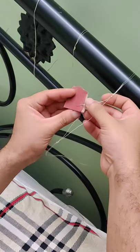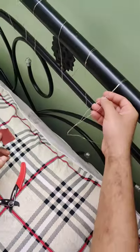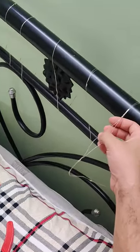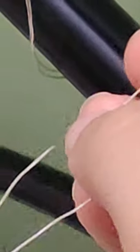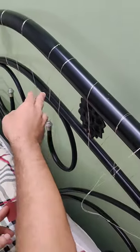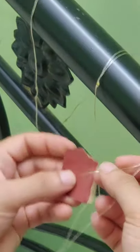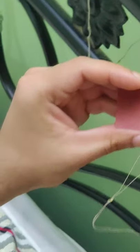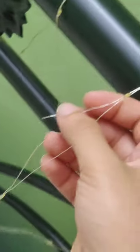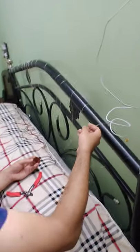So now as you can see, these wire ends are cut. You cannot directly solder them because these fairy lights, even though they are made of copper — copper should be brown — but since these are silver, that means they have a small non-conducting material over the wires so that the wires don't short. If the material was conductive, wherever the two terminals or wires touched each other, they would short at those points. So the entire wire is coated in a non-conductive material, and you need to remove a little bit of it so that you can solder the ends together.